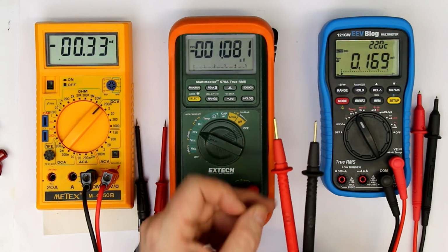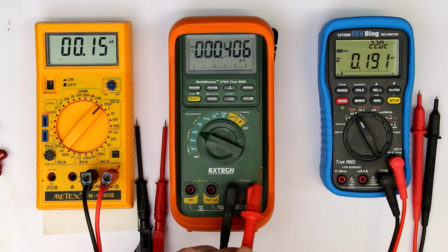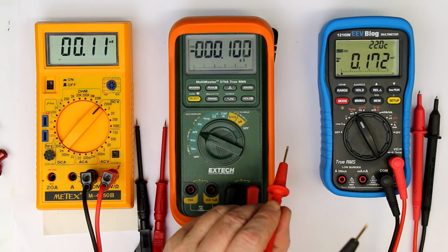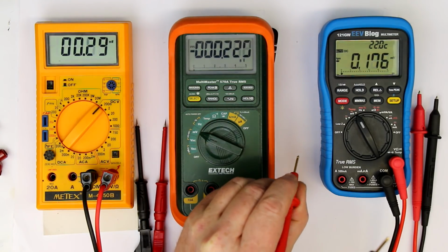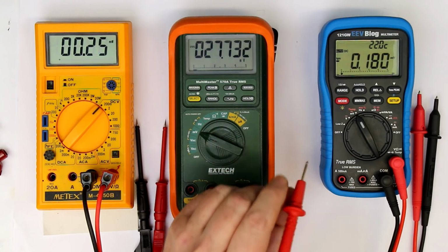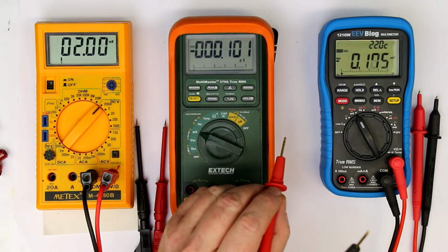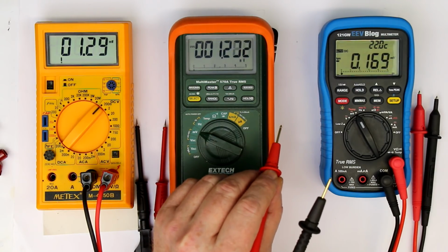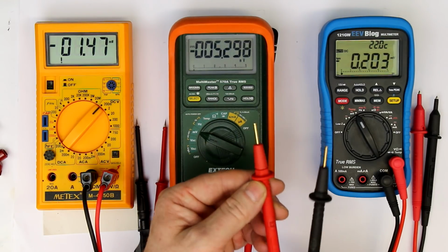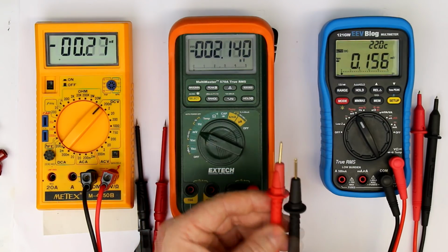And you will see also that all modern probes have this little ring here, so that you cannot slip, for example when you have wet fingers, over this little ring and accidentally touch the probe tip or touch any high voltage point in your device or circuit under test. So this is mandatory to get the CAT rating for the probes.